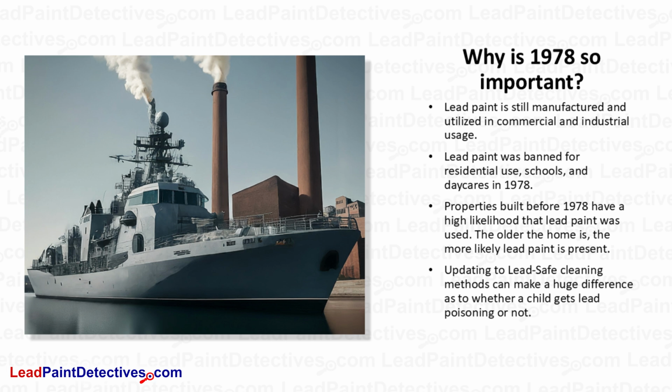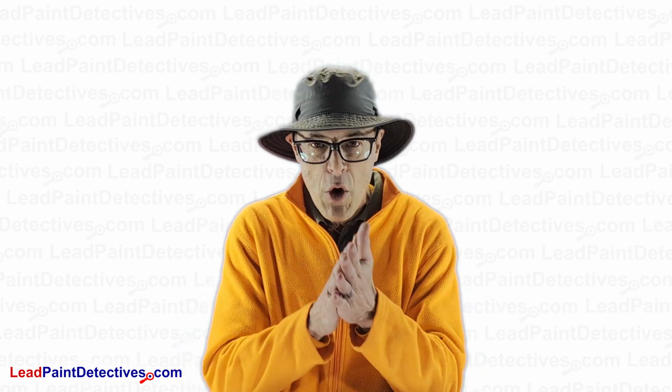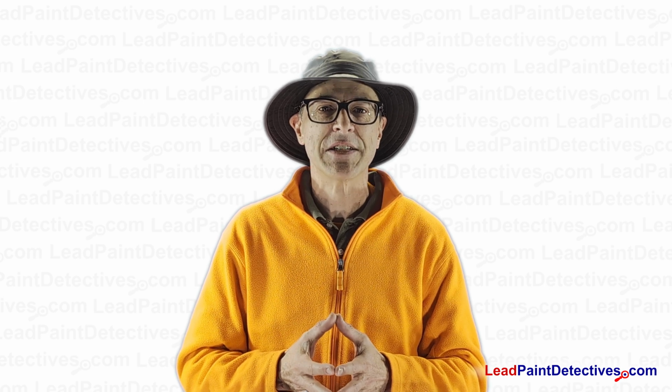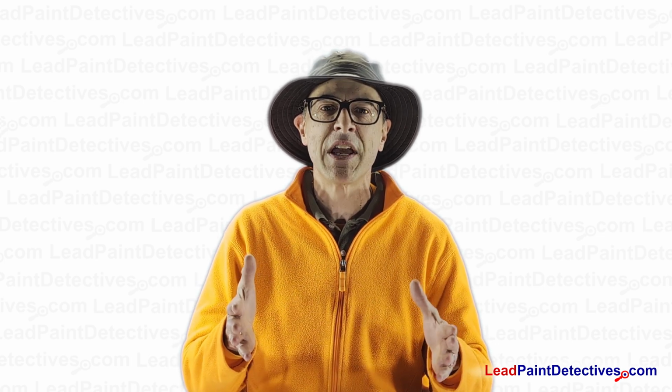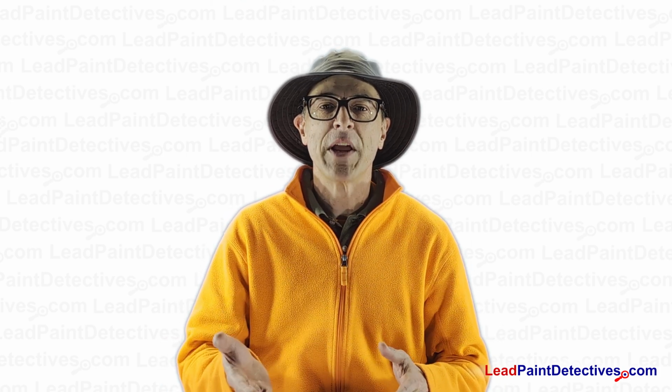A change from just cleaning to lead-safe cleaning can make a huge difference as to whether a child gets lead poisoning or not. Invisible lead dust is created from two lead-painted friction surfaces rubbing together. That's why it's difficult to deal with invisible lead dust, because it's like microscopic, little tiny spiky balls that stick to everything. Knowing this, you can update your cleaning methods to lead-safe techniques and protect your children, your family, and anyone you invite into your home.